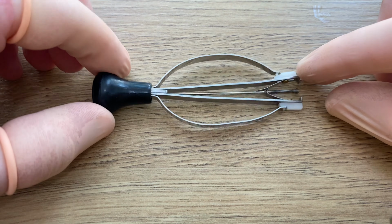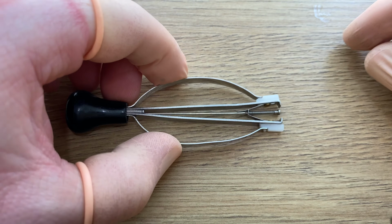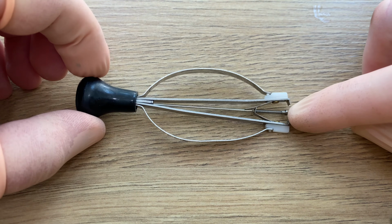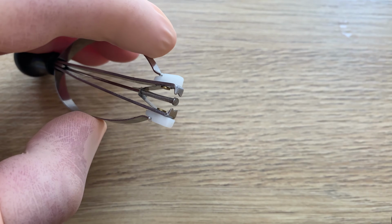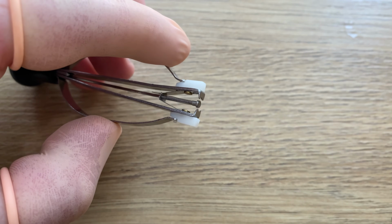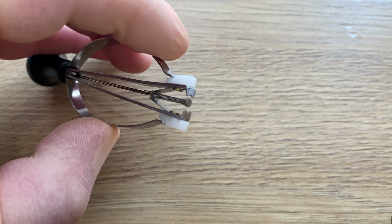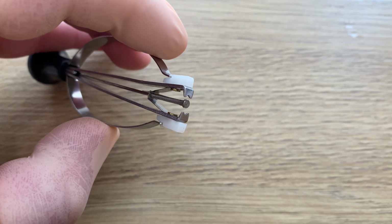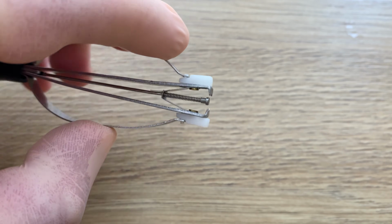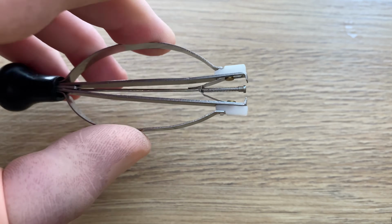The last tool to talk about would be the Presto tool. This is more of an automated tool, you could say, for removing hands. Basically, you squeeze the two sides of the metal piece there, and what happens is the plastic stumps sit on the dial, and the two levers on the end lift up the hands like so. This is a cheap version of the Presto tool. This is one that's a material supply house's homemade version, I guess you could say, or they have made for them. To be honest, it's a piece of junk.